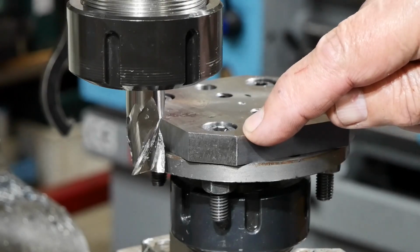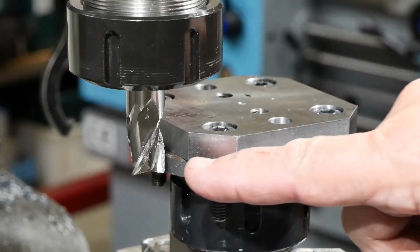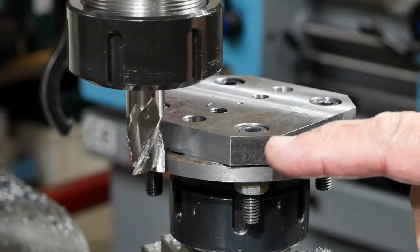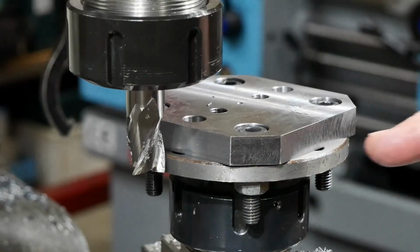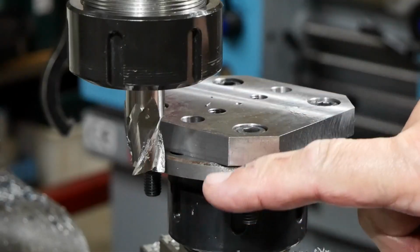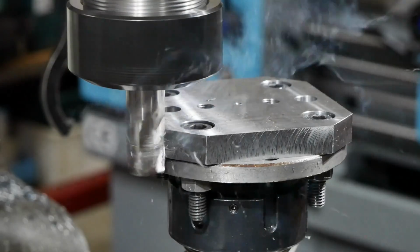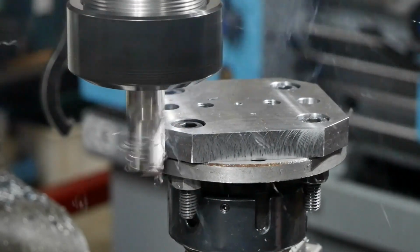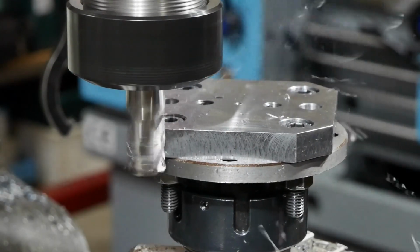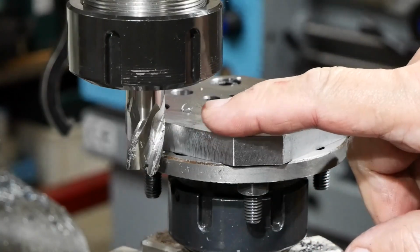So with the 4 corners clipped off, I've mounted it on the fixture and I'll rotate the workpiece around until the cutter makes contact. It's just touched on a couple of the corners, so I'll feed it in 1mm. I have the cutter set for full depth, so we'll see how that goes. Seems to be coping nicely with that.